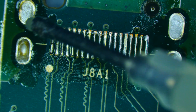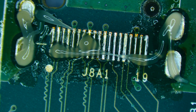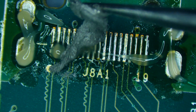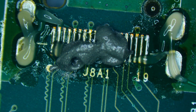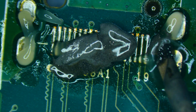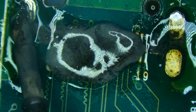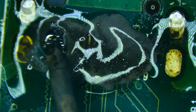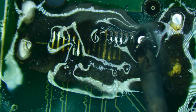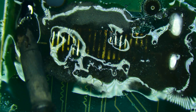This isn't necessarily my favorite way of doing these, but it will be the simplest for those that haven't done it before. What I'm going to do is take some 138 solder paste — or if I had 138 solder wire I would use that, or anything that's a low melt — and we're just going to put down a blob of it there. I'm going to set my iron to around 350 degrees and try to mix this low melt 138 into the legs of the factory solder. This solder isn't designed for strength, so we will be removing it, but it's going to make it much easier to clean out those holes. We'll also mix it with the solder that's on the pads, and the more you have to mix, the more it dilutes the high temperature factory solder inside these holes.